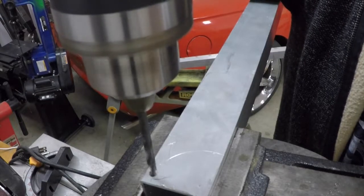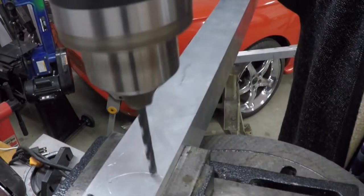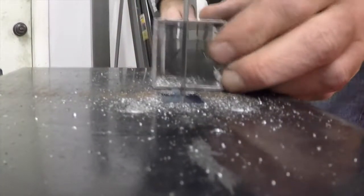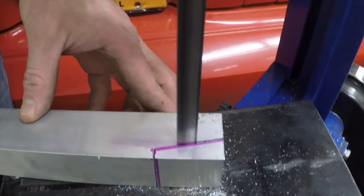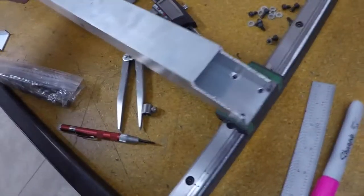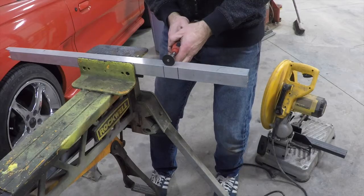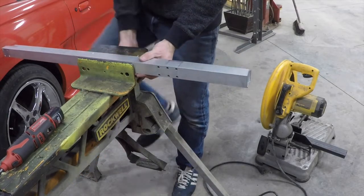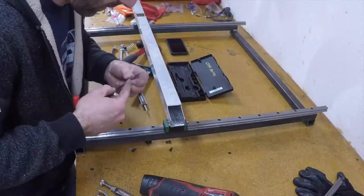Make a quick check, drill your holes — one, two, three, and four. Now we've got to cut the aluminum x-axis tube. Zoom through this real quick, and you can see they are relatively perfect. Doing the same thing for the other bearing. Had to cut it with a rotary tool in order to expose the threads so I can get access to them. And they are perfect.